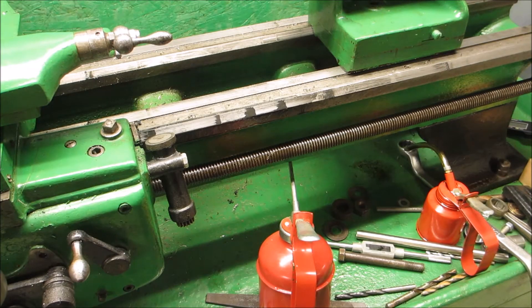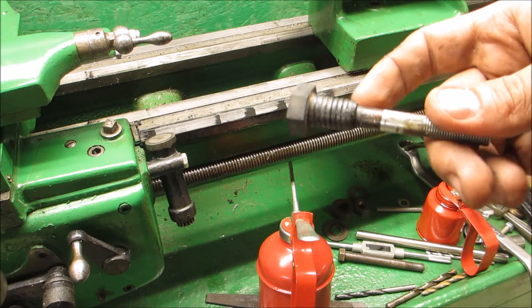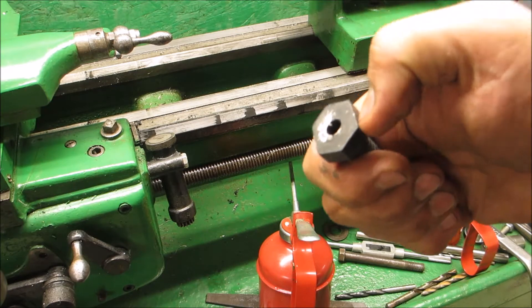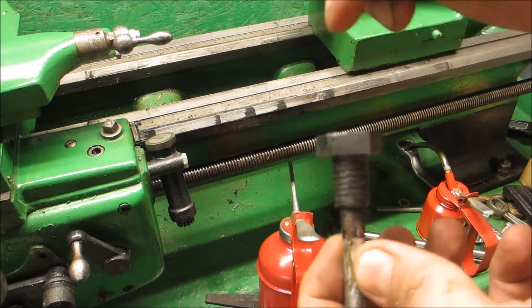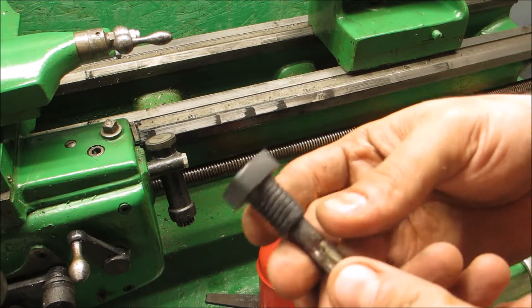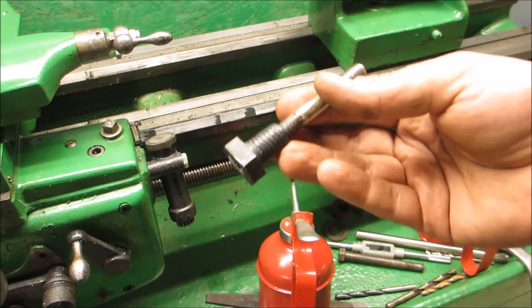After turning and tapping and everything else, it's not welded — it's soldered. It's threaded in and then I soldered it. It seems like the flux has actually parkerized the metal. There's a bit of solder because I fed the solder from the top — I heated the whole thing up, fed solder from the top with flux in there, until it flowed out of the sides. It seems like it really parkerized or coated this thing, which prevents rust. So that's a good thing.